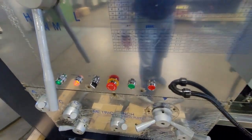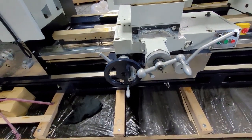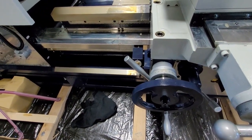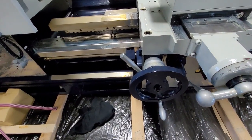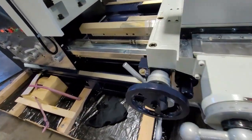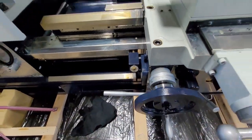I'm going to turn the spindle on. These machines are a little different due to their size and feedback our factory has gotten over the years. They're very popular in the oil field where there's a lot of heavy threading done. On these machines, we have the thread dial and the threading gauge lever on the left-hand side of the apron. This way, the operator can see the lineup of the tool very nicely with the thread dial and the threading lever — versus on most lathes, trying to do it from the other side and then seeing where the tool is, it's very difficult. So on this one, it's all in line. When you're ready, you engage this lever and now you're threaded.